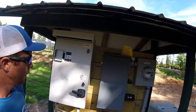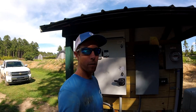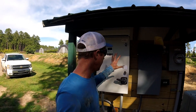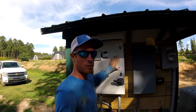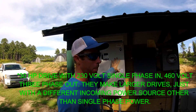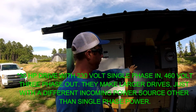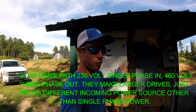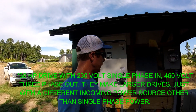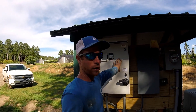That's what's really nice about it — we didn't have a choice here. The customer had the capacity to run another pump but didn't want to spend the money to get three phase in. Phase Technologies does make a drive that can handle up to a 30 horsepower pump. This pump here has a 125 amp breaker, and on the power side it pulls about 96 amps on each leg. They make a 30 horse that can handle single phase in, 460 out.